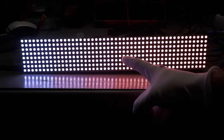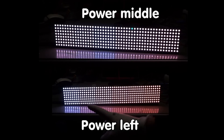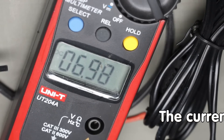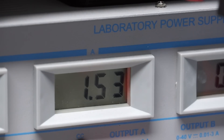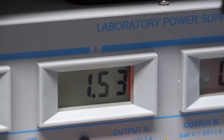When all pixels are on, the 30 AWG wires used for wire wrapping are overloaded — power enters on the left side and the panels get less and less voltage toward the right. Tip or trick eleven: connect power in the middle of the panel, not at the end. Now the intensity distribution is even across the panel. However, the current now goes up to the full 8A of the power supply, which is still not the possible maximum. I measured the current draw of a single matrix at 1.5A, which sums up to 9A for 6 tiles.